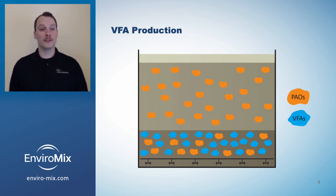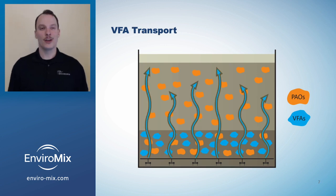Under this environment, there's a surplus concentration of VFA in the blanket and PAOs outside the blanket awaiting their turn for the process to continue. Transporting VFA from the blanket to the PAOs in the upper layers is accomplished through short, gentle pulses of compressed gas. These pulses transport the VFA upward without re-suspending the blanket. Overall, the gentle pulsing helps to keep the PAOs and VFA in happy balance, resulting in an abundant PAO population.